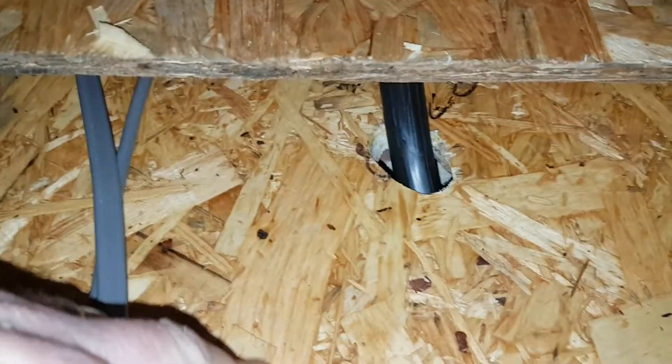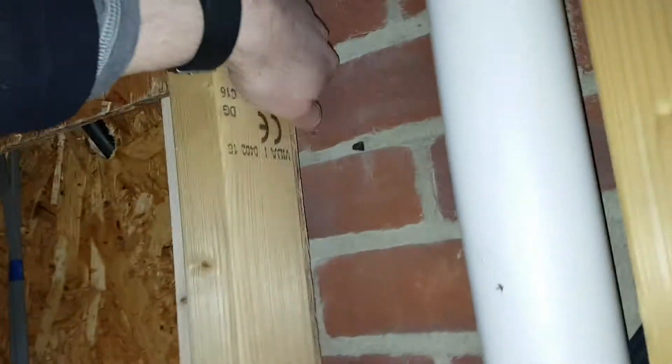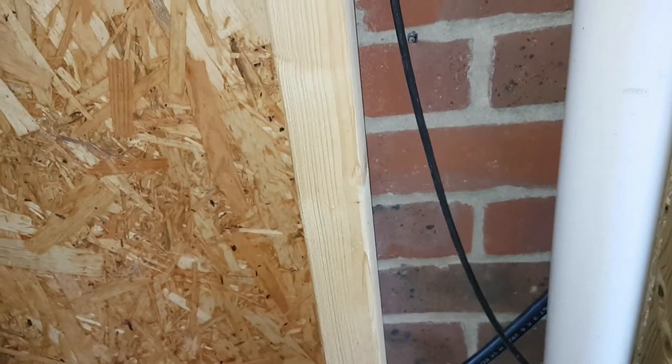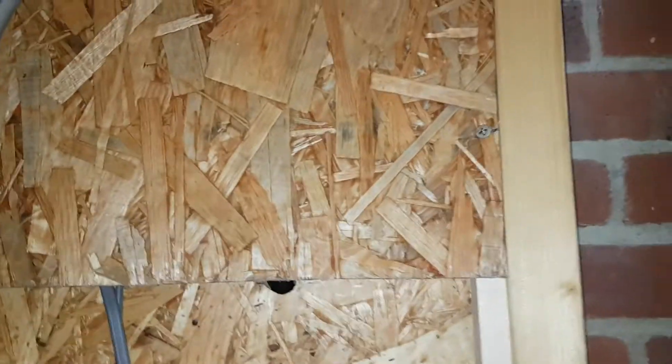Now the telephone cable actually goes into the house — it goes down and in. Then we've got 10mm armored cable which comes through at this point, looped around here so any rainwater will drip off at the bottom. At the bottom we've got a 6mm armored cable which is curled up outside for electric car charging, and then we'll box this off.